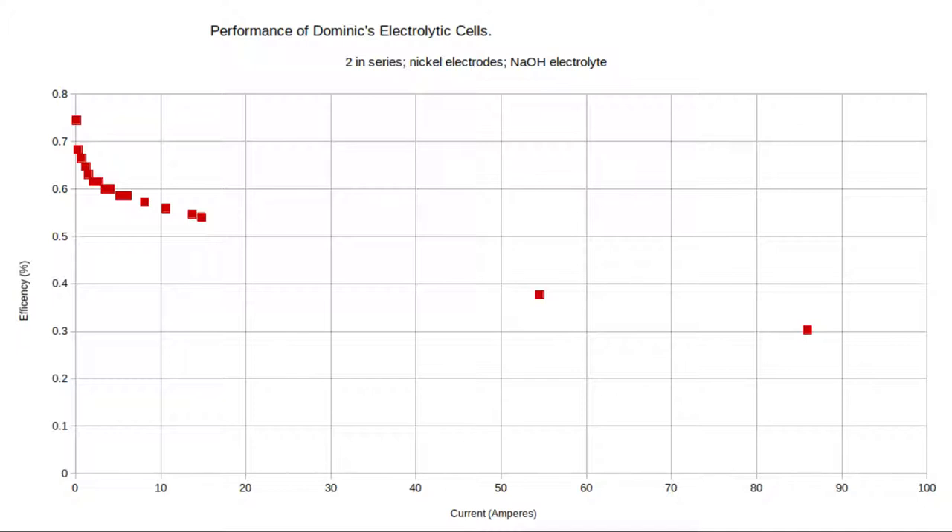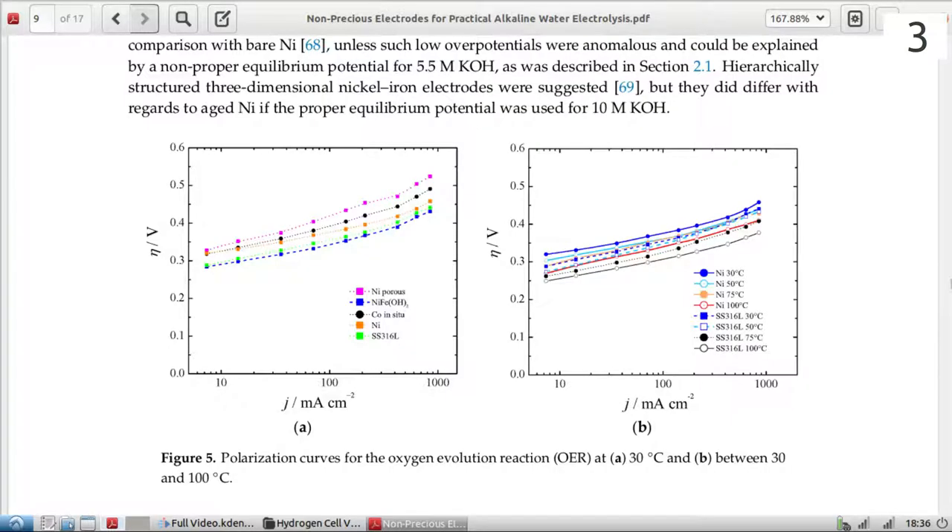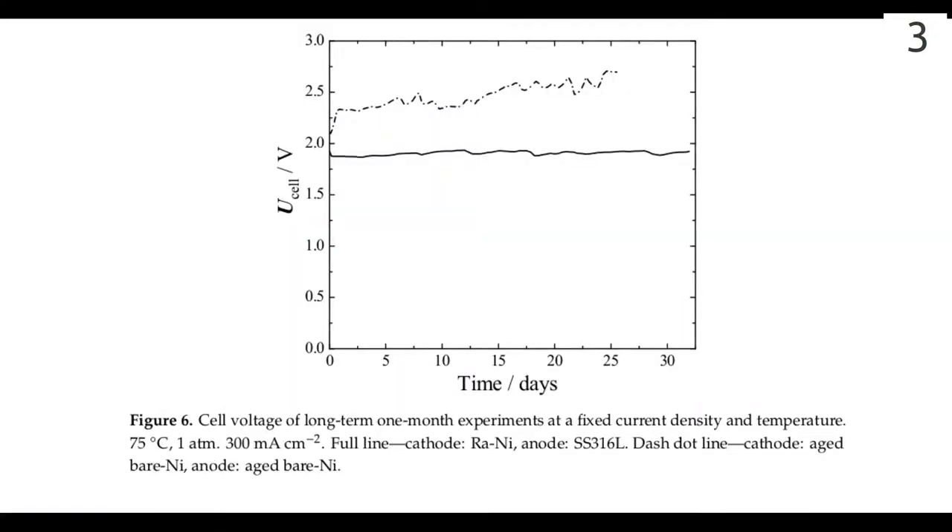There are quite a few things I could have done to improve the performance of this cell. First of all I used nickel for the electrodes. Nickel in many ways is a very good choice because it resists the electrolyte and doesn't dissolve into it. But there's some research which shows that stainless steel is actually more efficient as an anode for producing the oxygen gas. One concern though is that some people worry that submerging stainless steel in sodium hydroxide will leach chromium or chromate into the solution — and chromate is a carcinogen, so we definitely don't want that. But it's still a topic for research and we don't exactly know yet if chromate leaches into the solution. If anybody watching knows the answer, I'd be very interested to hear — please contact me or make a comment below.